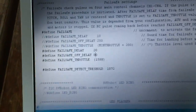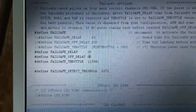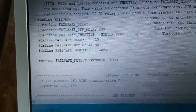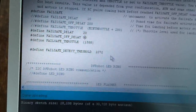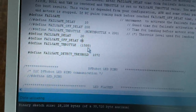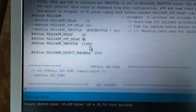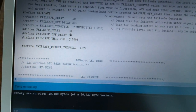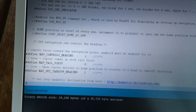Finally I realized what the problem is. First of all, you have to know the hover position. In this case you can see that the failsafe throttle is 1588 — this is the stick position whereby my quadcopter will descend gracefully. So if I want it to hold its altitude, the throttle has to be 1590. You have to try and error on your own SuperX quadcopter to find out what value is yours. For mine it's 1590.